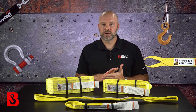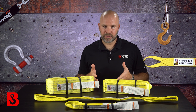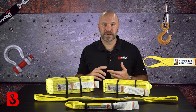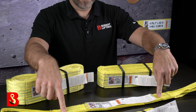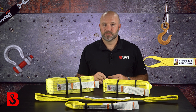There are some important safety considerations when it comes to synthetic slings. Unlike alloy chain or wire rope, they are more susceptible to being cut and damaged. The pro is they're affordable and easily replaceable — much cheaper than a comparable wire rope sling or alloy chain sling. The con is they're more prone to damage. Make sure that your sling has no obvious cuts, rips, tears, or burn marks, and that it hasn't been exposed to any extreme chemicals. If the sling becomes brittle or hard in your fingers, it's a good idea to replace it. There are also safety warnings in the form of red yarns on the inside of the sling body — if you eat through too much of the sling's outer surface area and get into the safety yarns, that sling needs to be pulled from service immediately.